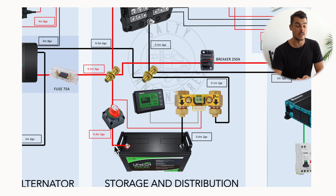I used quite heavy gauge wires on the two terminals that go to my bus bars, obviously because that's going to be where the most current is drawing, so you want your bus bar to have the least amount of voltage drop. All the items I've used in my entire build I'll link in the description below so you can get the exact same things and basically carbon copy this diagram if you want. I'll also make this diagram available in the description below and on a website I'm starting up soon.